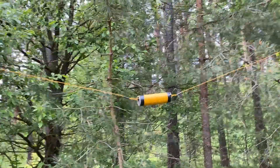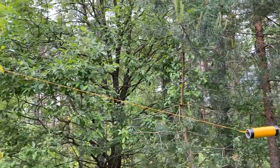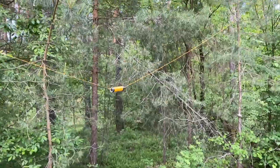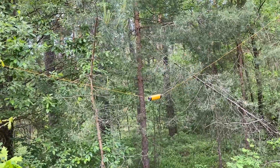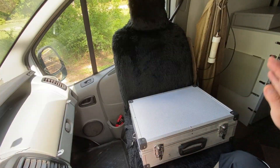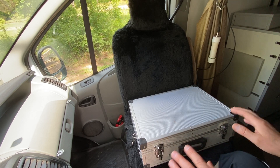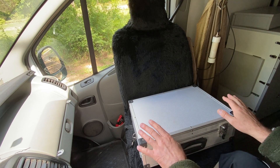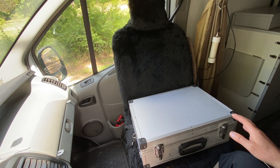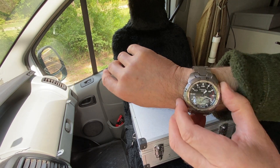The loading coil for 80 meters is just maybe two meters above the ground, so it's pretty low. There is a separate video with all the dimensions — if you're interested, there's a link in the description. The overall length of this antenna is just maybe 22 meters — it's a pretty short antenna for the 80-meter band. Now let's make a small experiment: after we have the antenna ready, let's see how much time I need to get my go box ready and on the air, from fully packed to fully functional. Let's start my chronometer watch.